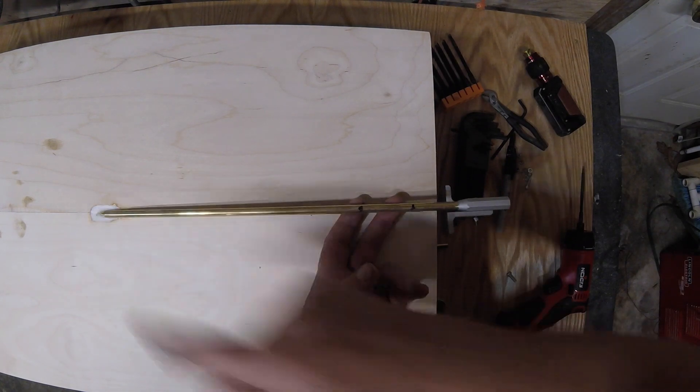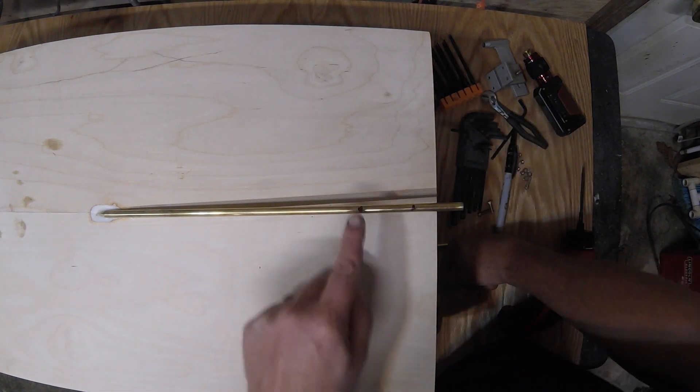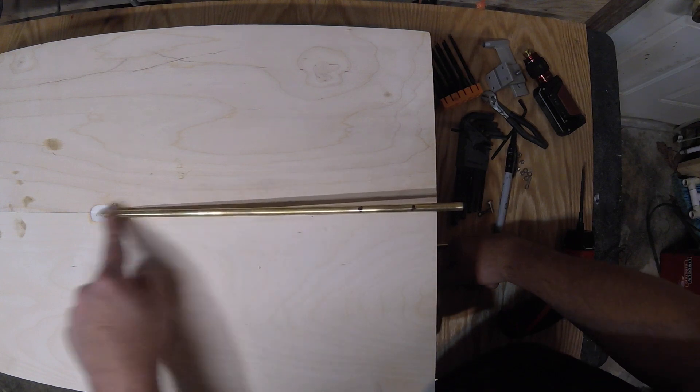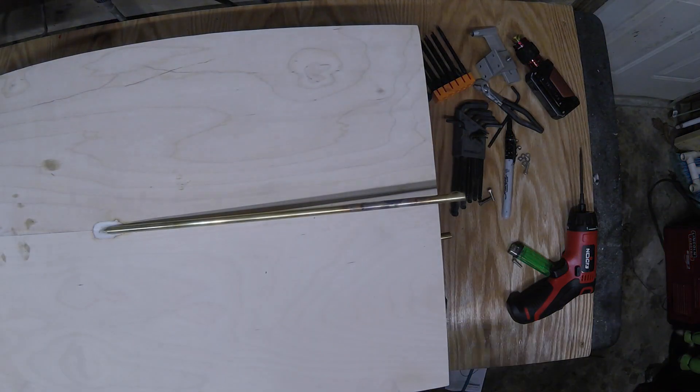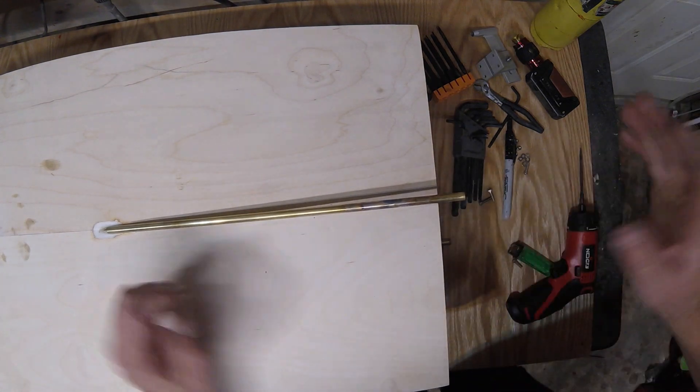You can do this before you seal in your shaft, but I don't. We're going to angle this up a little bit. Remember what I said in the annealing video — copper and brass dissipate heat exceptionally fast. I'm going to anneal this bit right here between the marks, and it'll probably get hot to maybe here. We don't have to worry about it burning the boat. Let me grab my torch. Turned off the lights for a little mood — if you turn off your lights you'll be able to see the glow better. You can do it from both sides if you want if you're one of those OCD dudes. Try not to burn your arm off. That's all it takes.